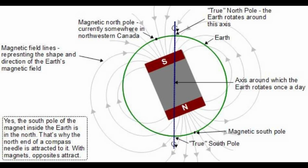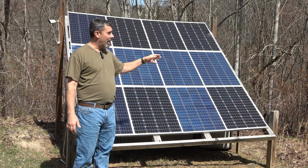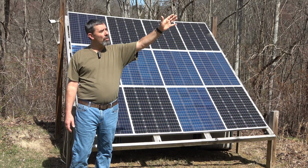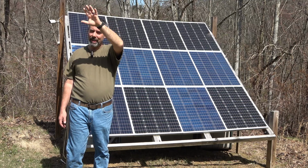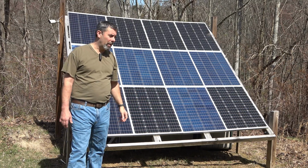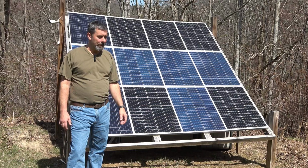You want to maximize the amount of time the sunlight is going to be hitting these panels fully. For hitting it at your true south, the sun's going to rise in the east, come up over the mountain range here, and hit my panels. In the wintertime, it's going to hit them for about 3 to 4 hours at the worst month of the year, which is January for us, or late December, early January. And in the summertime, it's going to be out for 7 to 8 hours a day on all of these panels. So that is excellent charging capacity when that is happening.